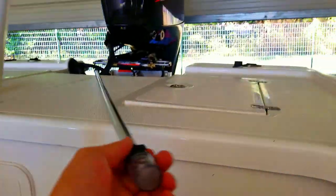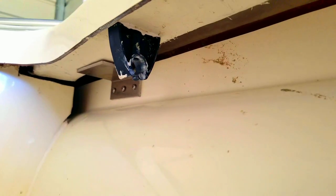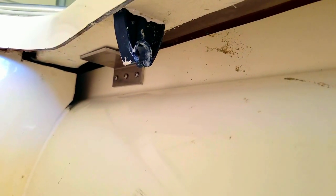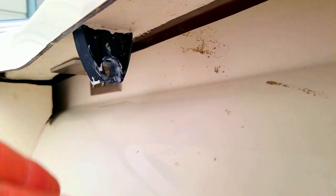The running light mounts right there on the stern, and the very first time I went to pull the running light out, that little mount just ripped right out of the fiberglass — and the other one almost did on the other side as well. I took them out completely, got a slightly thicker stainless steel screw, used marine 5200 sealant, and put them back in. You should be able to just pop the light out without the mounts ripping out, but they did. Mako, you might need to address that.